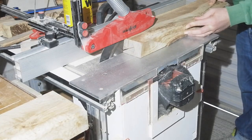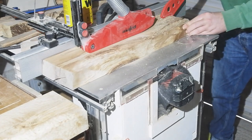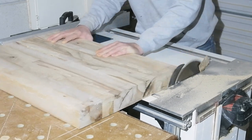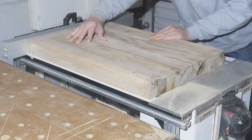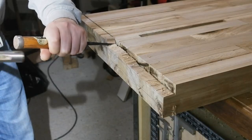Here I'm ripping down a couple of pieces from the remaining 50mm planks — these I'll use to make breadboard ends for the top. With those cut, I square up the sides of the top. Next are the shoulder cuts each side so I can create a large 34 by 25 mil tenon or tongue each end.